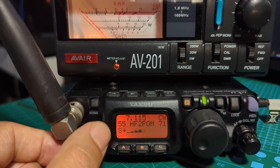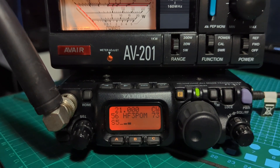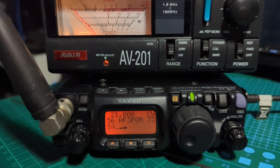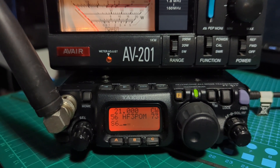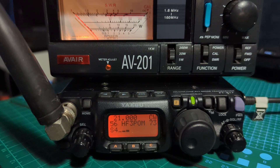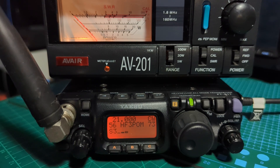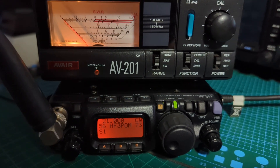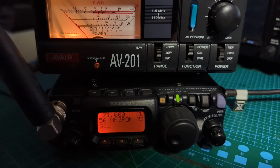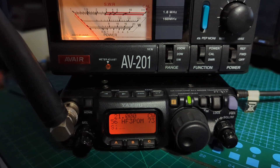I'm not going to touch the rest of it, but that's what you would do. What we're trying to do is get our radio nearer to a Yaesu 818 as possible — but I would only do that with the ND model, which is as far as I can see the same hardware. The next bit we're going to show you is the TCXO module, which is really easy to install. I'll just show you where it's positioned and the module in the next part of the video.